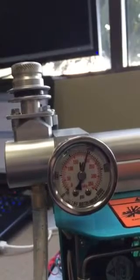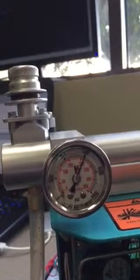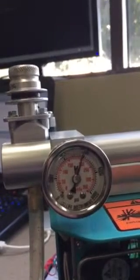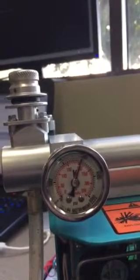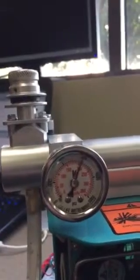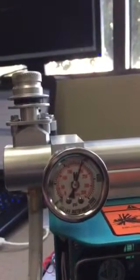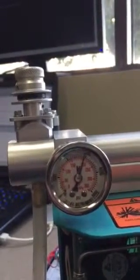And you're going to see the PID loop is going to kick in and keep that level right at 3,000. As the process runs a little more, that PID loop will find a happy medium to where it stays at one level just by roughly switching the nozzle. So it will hold that level much more steady once it levels out.